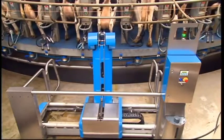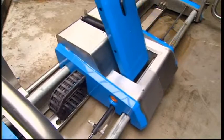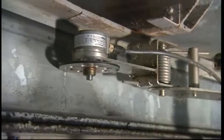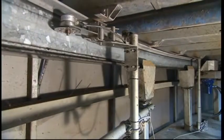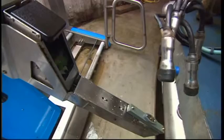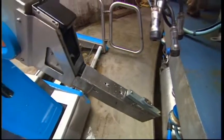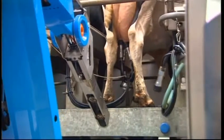The SR1 starts the cycle at the beginning of the path the system is capable of travelling. Encoders mounted on the platform indicate the position followed by the arm. The camera system on the arm locates the position of the cow's back legs and checks whether milking has been completed and the milking cluster has been removed.